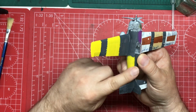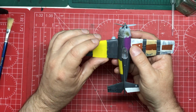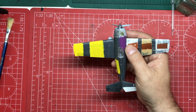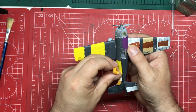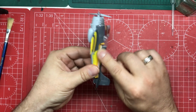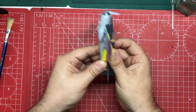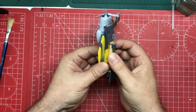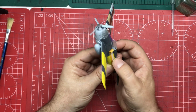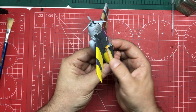Right, now then, this has all been drying for 24 hours, so everything that you'd seen so far I did yesterday morning, and we've left it to dry. So I'm now going to do this masking test. There is no varnish or anything like that on here. It's completely just the paint gone down and nothing more. And we'll go in and press it in more than you'd normally do, just to be extreme and see what happens.